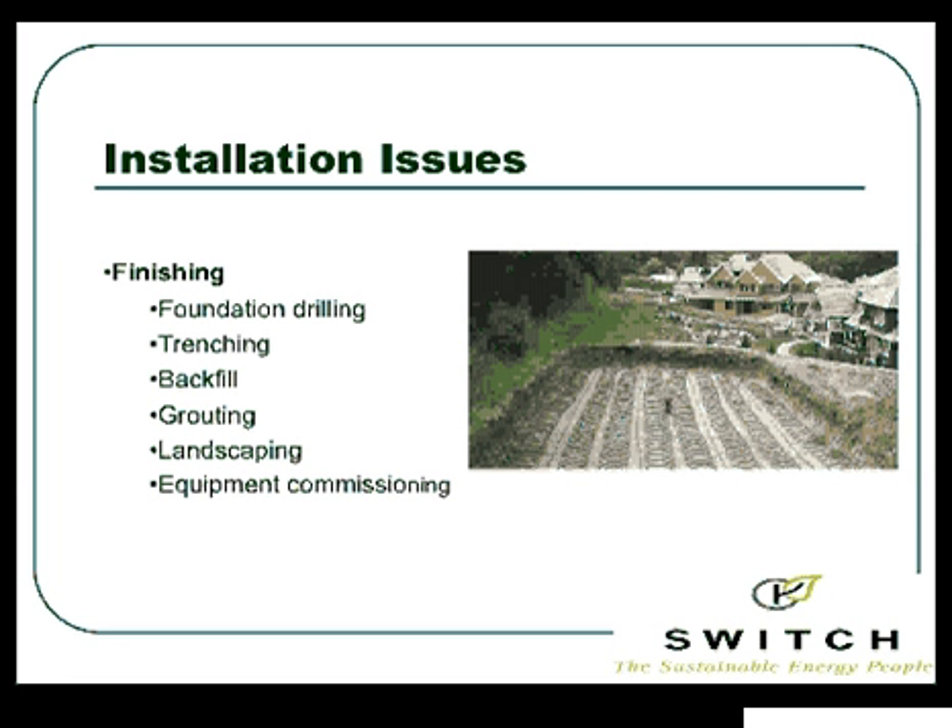Is that where your question is, whether it's not renewable energy? The reason it's questioned as renewable is because of how much energy I need to put into this system to operate it. A PV system — I have the energy embodied in manufacturing it, but I'm not necessarily putting energy in to operate it. And a true geothermal system, where we're taking hot springs or molten lava, we're not putting energy into that — we're just removing energy out. Here I need to put energy into the system to get more energy back out. So it's all in the definition of renewable.